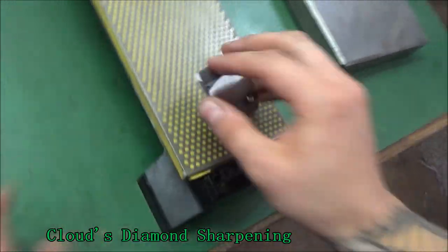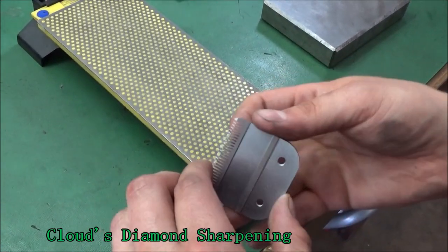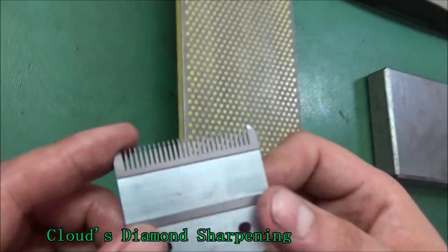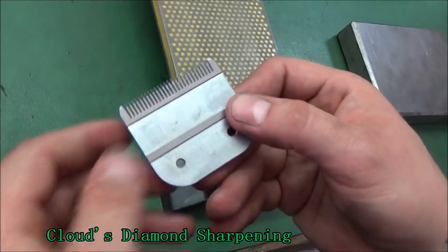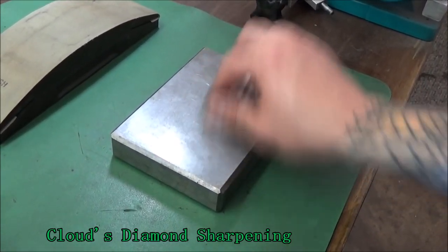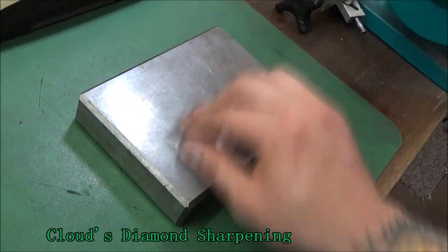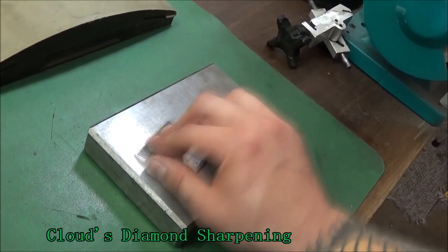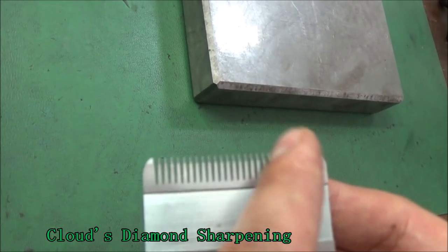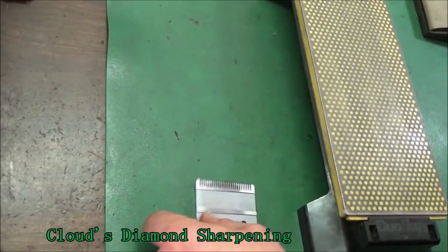That's not done because you see a little tan. Still a little more — still not done. Okay, there it is, nice and flat — dull is what I call it. So if you notice, the middle is hollowed out, and even if you get a flat pattern, that's when blades go dull. So I'm going to show you what it's supposed to look like and we'll go to the sharpening wheel.